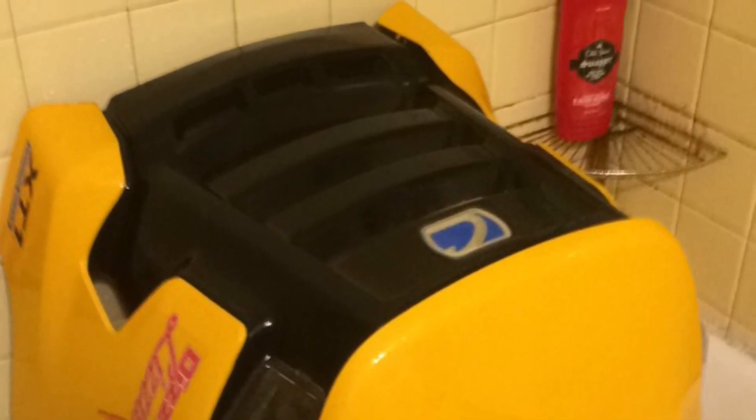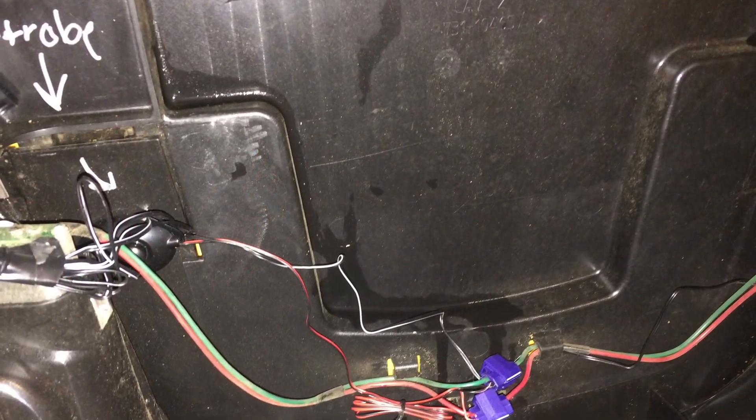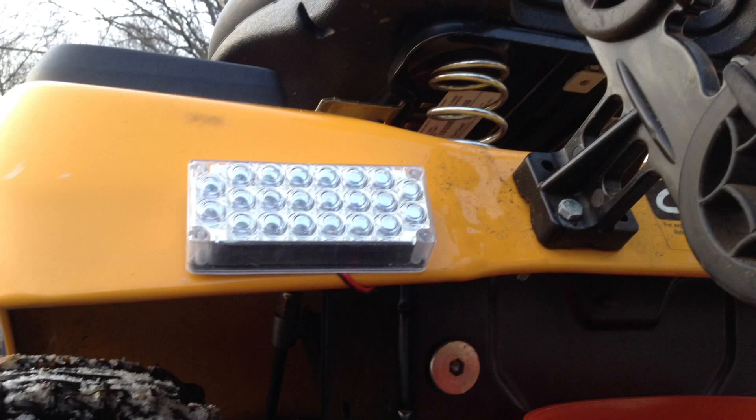Here's the picture of the snow fighting fleet, and as you can tell the most obvious change I made was I put in a strobe system. The LEDs had an adhesive backing, so in order to get them to stick properly I had to wash off the bonnet with warm soapy water in the bathtub. I wired the LEDs to the tractor's headlight wire that ran into the hood or the bonnet and connected it in that way. So when you have to take off the hood, the only thing you have to do is disconnect the one stock wire from the factory, so everything is tidy and neat up in the front. And they certainly do add a nice little touch to the front of the tractor.